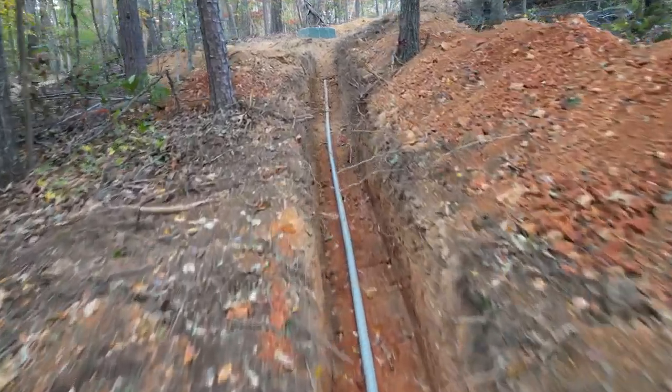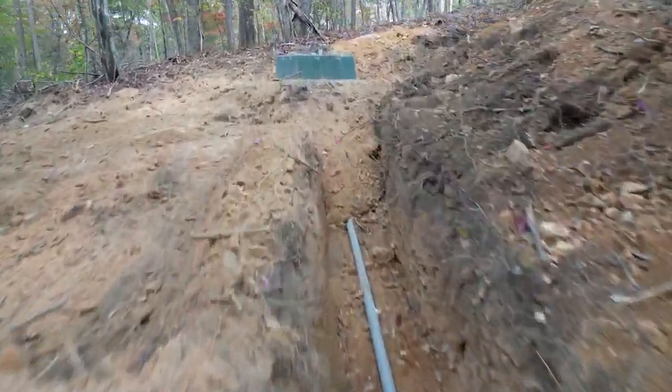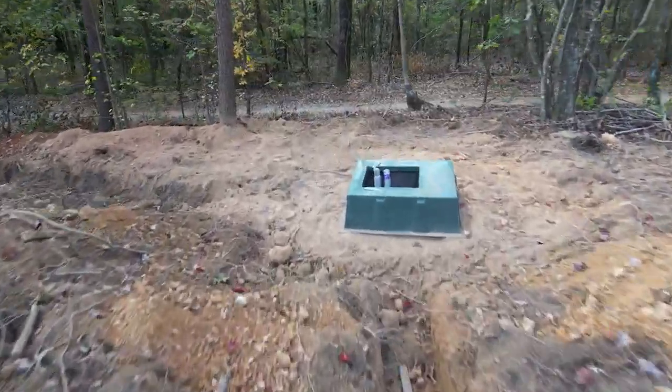What's interesting about that too is that we didn't necessarily have to put the water and electrical separate. In this county, they're allowing you to put electrical first. If it's high voltage electrical, go 3 feet underground, and then put a foot of soil on top of it, and you can put the water line on top of that. If it's not high voltage, if you're after the transformer, then you can go 2 feet underground, and you can put the water line on top of it.